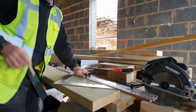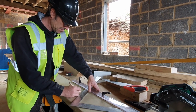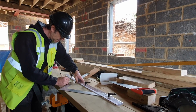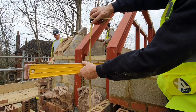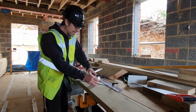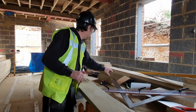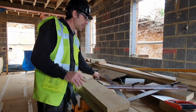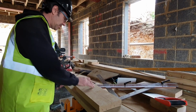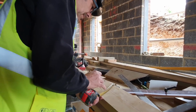We've got a 400mm drop currently. So we'll step that off. That would be a 400mm drop. Now, what we need to do is make sure the bird's mouth is exactly the same height from the pitch line as the rafter. So on the rafter, we're using a 7x2 and we're using it at 2/3, which is technically what we should always be, 2/3. And so we'll just mark that on here and I'll give you a measurement.